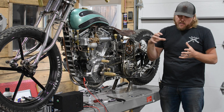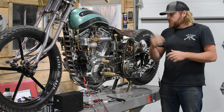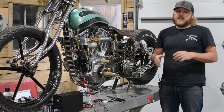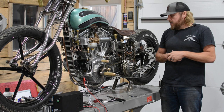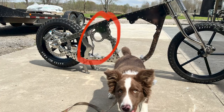The crank was kind of like a manual backup. This one had that 12-volt motor in the whole assembly on what I call the bell housing - it's kind of like the face of the starter. What I did was I took it, I cut it off, and then I put it in my mill and milled it out, cleaned it up so it looked more factory-like, and it actually shrunk it down quite a bit - shed a bunch of weight. The starter with all that on there weighs roughly around 26-27 pounds. It actually fit the frame really well once we had the frame made. It tucks in and mounts where the oil tank would actually be on this bike if it was a factory style bike, so it actually looks like it belongs there.